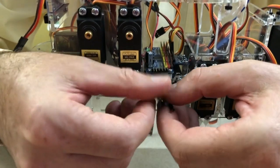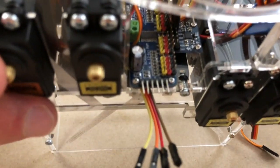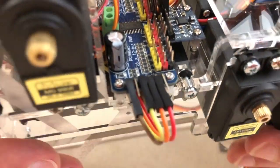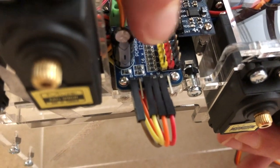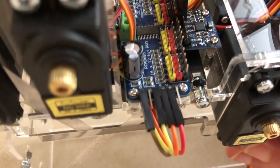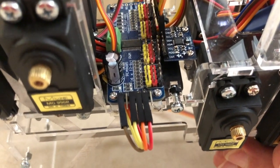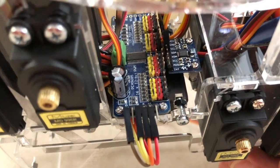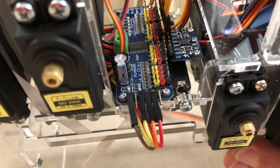Now I'm going to do the same thing over here — this is the same I2C bus line, and those are also labeled. Your controller card will more than likely also have those labeled, but double check. Red is 5 volts to the logic on the board — it's not the power to the motors. Remember, the power to the motors comes through this green terminal block over here. If we wanted to power the motors through the pin line, we would use the last pin which says V++. But we're actually using the green block because it has a protection circuit on it — it's just a better way to connect power to motors for this particular board.